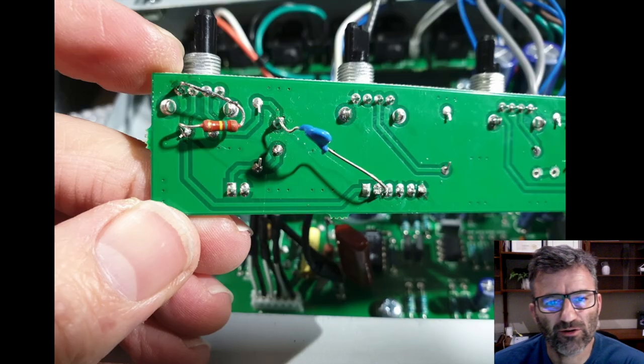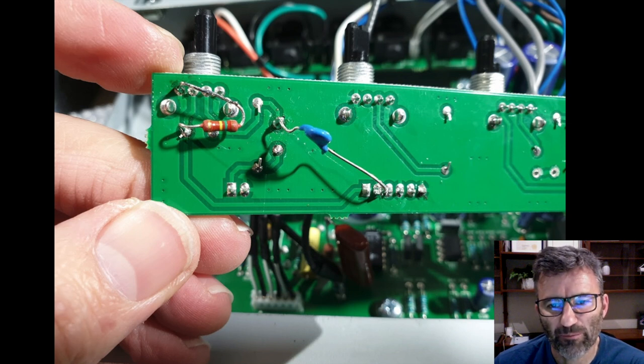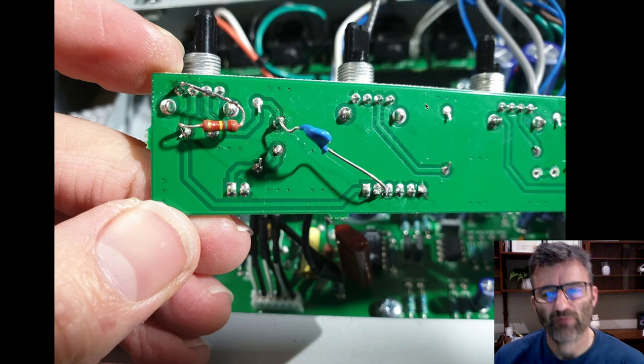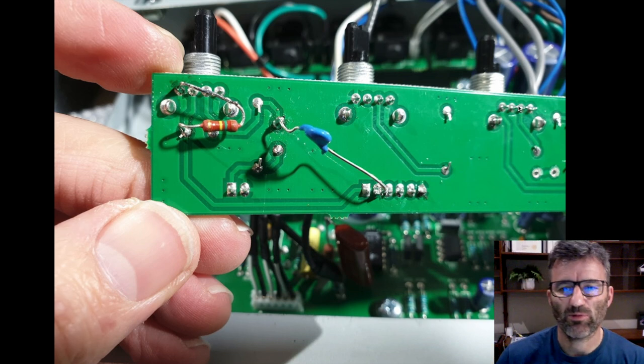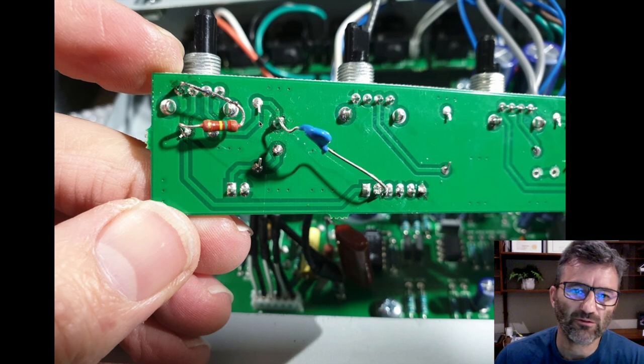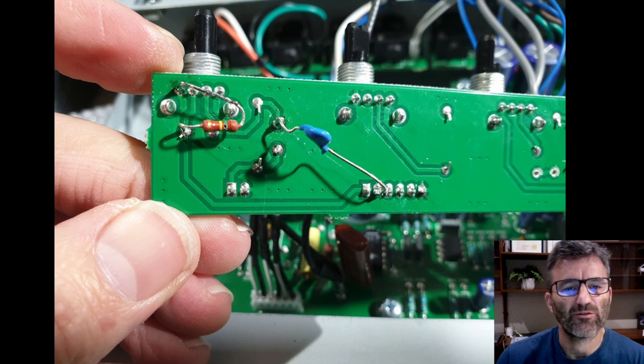And this is how I do the changes at the gain pot, right? So this is under the PCB that the pots are mounted on. You just got to unscrew the nuts from this thing, and it'll just flip out of the chassis. You don't need to pull any of the wires or the headers off the PCB. It'll just flip over. So this is the 150K resistor that is going from the wiper of the gain pot to ground.